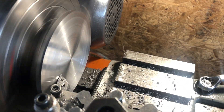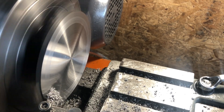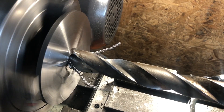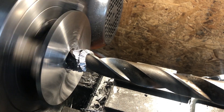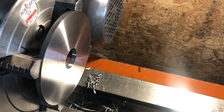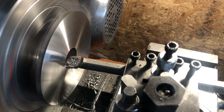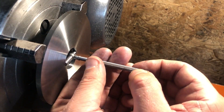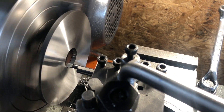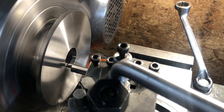This can then be faced to thickness, and the centre bored to 2.938 to fit onto the mount. Now this needs to be a pretty good fit, as this is the locating feature for the plates, and a poor fit here would make aligning the finished plates with the plunger arc, if not difficult then definitely irritating. We are to size, and the fit on the bracket is good. A chamfer on the front and at the back of the hole completes the work in this setup, and we can move on to the OD.